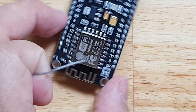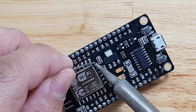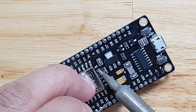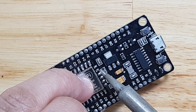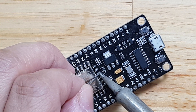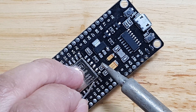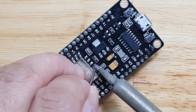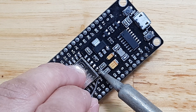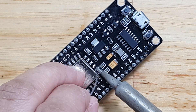The last six pins left are the ones at the bottom. I just have to put more solder on them. Let's top it up a little bit. I'm on the fourth one now, then the fifth one. Sometimes even if you don't top up it will be enough, but you know — it won't hurt.